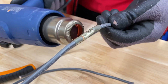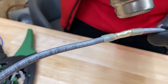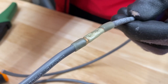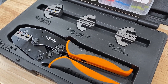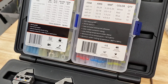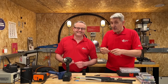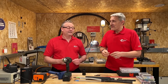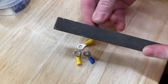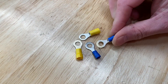The adhesive flowing out also provides strain relief, joining the two halves more strongly. We chose these particular ones — sold as a system with the crimp tool and crimps together — so they tell you exactly the right die to use, which creates the correct crimp pressure and strength. They also advertise the crimps as made from copper, which matters: a few years ago we bought some from a well-known online retailer, rubbed away the silver coating, and found brass underneath. Brass is not as malleable and doesn't bite into the cable the way it should.